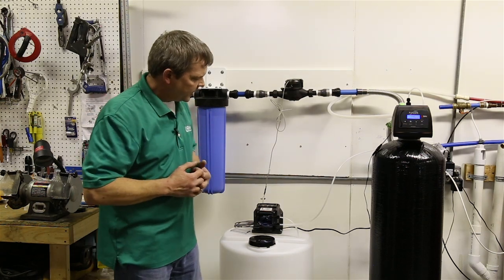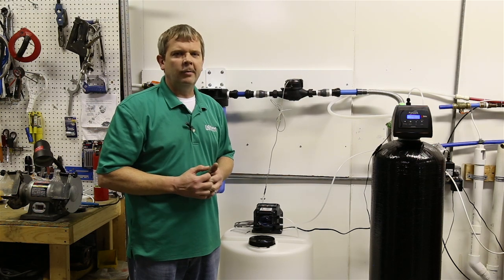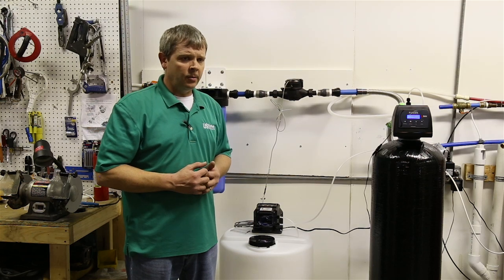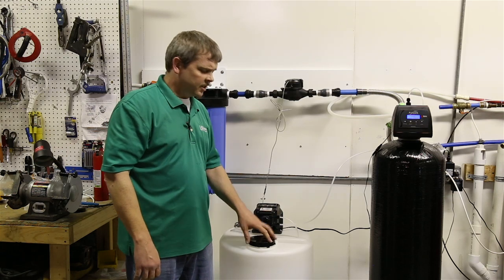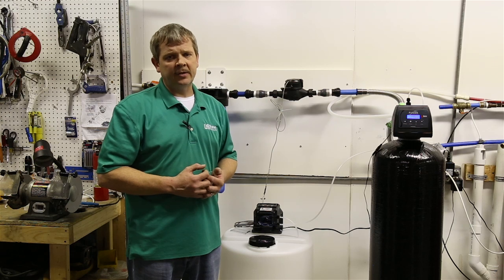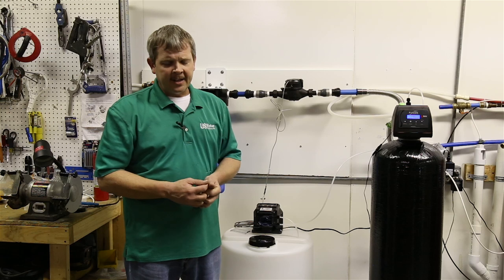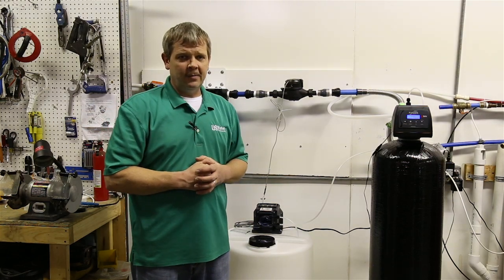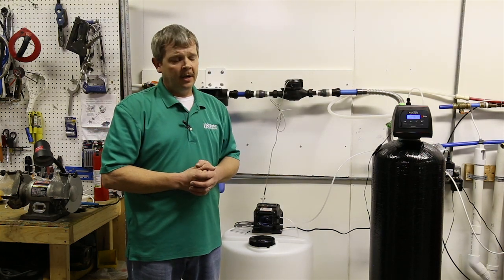Now, I know a lot of people will say, well, that kind of sounds, I don't know, made up. And for the most part, it is, and I'm going to tell you why. The main reason is that if you get a peroxide test kit and try to do residual peroxide testing to dial this in, it may take us 3 days because the test itself is so long, and then you've got to go back and revisit it and wait till it comes back. And I can tell you this: if you use this bubble method properly and do it the way I say, there's a good chance you're going to do better than you ever would with a test method, just by using your eyes.